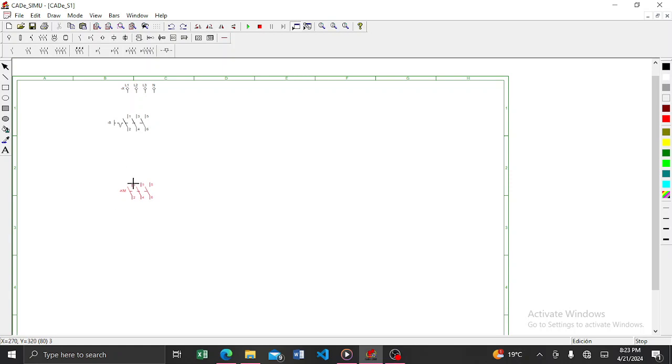Select the first contactor — this will represent the forward contactor — and this second one here will represent the reverse contactor. After that you need an overload relay, so select this one and drop it there. Finally, you need your three-phase motor, so come here and select the three-phase induction motor. That's all you need for your power circuit.